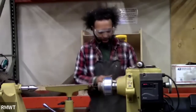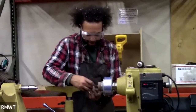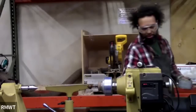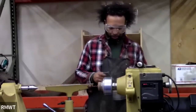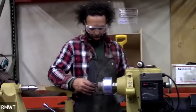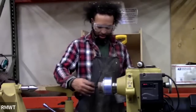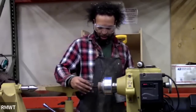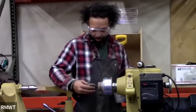It's good. And why don't I then just a little dry buff, ever so slightly dry, and then add a little bit of wax. When I add wax, typically the case with me, I'll go ahead and slow this down. I don't want you guys to wear it. I'll add just a bit of wax, just a little. And that's too fast still. Let's apply it between 300 to 600 RPM, that's good. And that's at 600 RPM or near it, a little over 600. A little bit of wax with Scotch-Brite, any raised grain at all should be taken away for the most part.